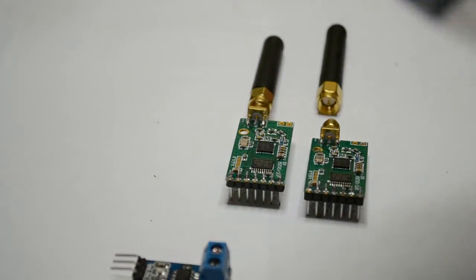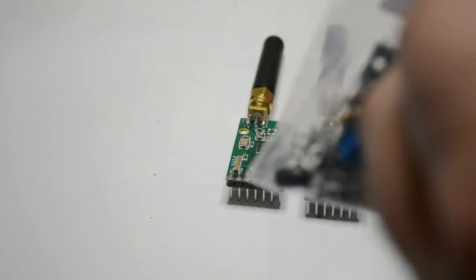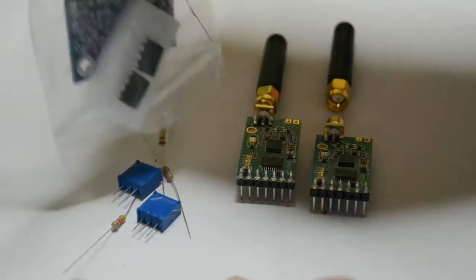So later I'll be wiring these up and giving the range test. But today I'm going to build this kit up. It's an infrared obstacle avoidance for robots, that sort of stuff. But I actually want it for a proximity sensor — maybe walk past it, it will turn on an LED light. I've got a solar panel charging batteries, running LED lighting. So I'll probably use that solid-state relay I demonstrated yesterday, and turn on some loads when you walk past this kit.